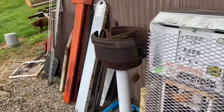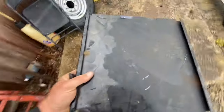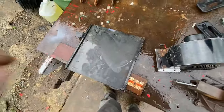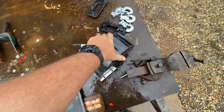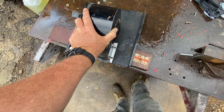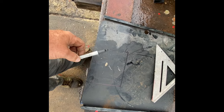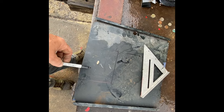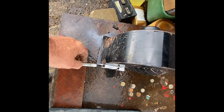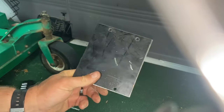Let's go find a piece of metal to make this block-off plate — there's usually all kinds of stuff around here at the shop. Here we go, this will work. We'll put the fan motor here, draw around the base to get a pattern for the block-off. Now we've got the block-off plate marked out. I'll grab a cutting bit on the angle grinder and cut that out. For the holes, we'll set the blower back up against the plate, center-punch the holes on the blower, and drill the holes in the plate so we'll be able to bolt the plate down to the floor.